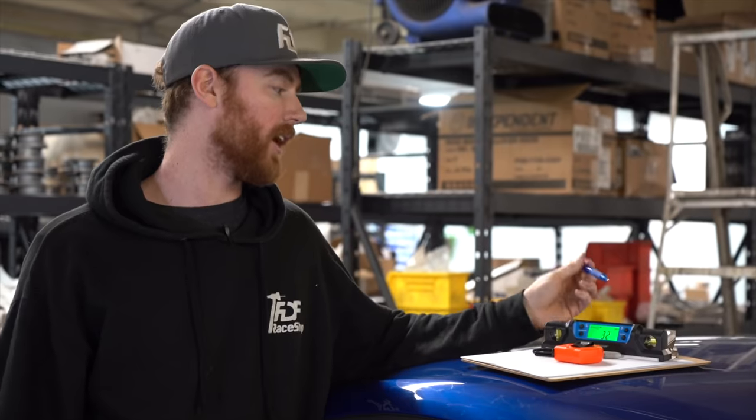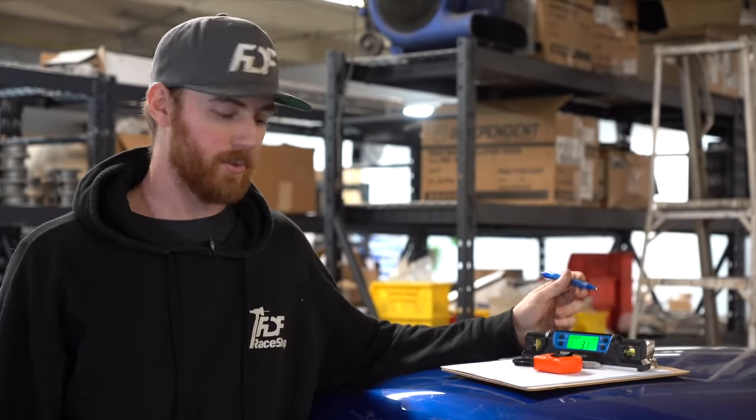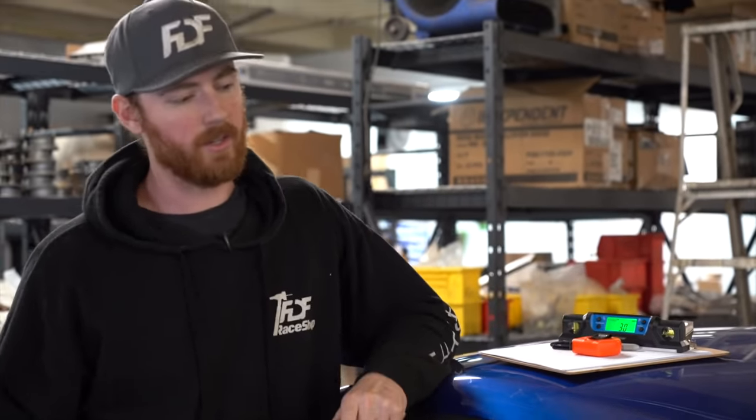So other than that, you may want this noteboard just to take notes on tube lengths and positions and whatnot. You just need to have it on hand. Other people use straight edges, and you can also get notching assistant tools where you can slide it up and it'll tell you where to notch the tube, especially if there's multiple copes going into one point. I have used them before. I did not like using them. I found that they weren't accurate enough for me.